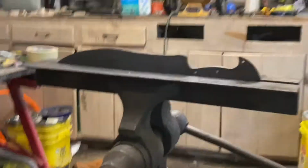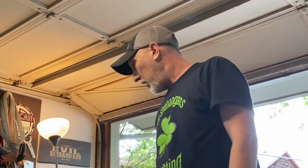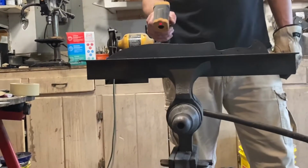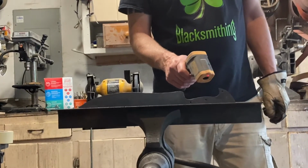This was straight when we put it in there, but sometimes they'll kind of bow a little bit during heat treat. But we've already done basically 2 normalization cycles already. We're doing kind of an extra one because I stamped our touch mark on one side of it today and kind of tweaked it just a little bit, so I wanted to go ahead and do another one just because we put it under some more stress. But if you do all your thermal cycles, your normalization cycles and everything, you probably won't get a warp on the quench.